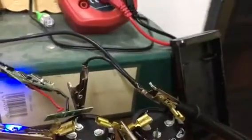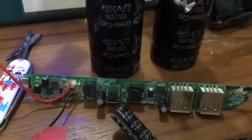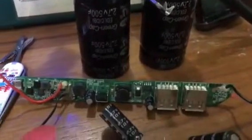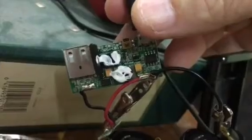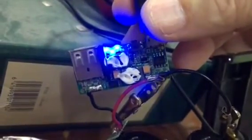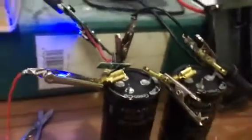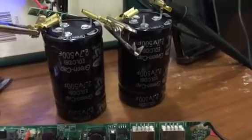and if you are in a pinch for a supercapacitor charging circuit board, then these old battery pack circuit boards will do the job for charging up your supercapacitors. They've got all the goodies in there for limiting the voltages. So that's just a quick idea for anyone that's interested in this sort of thing to try it out.